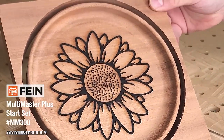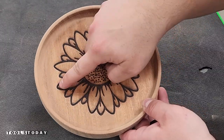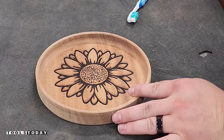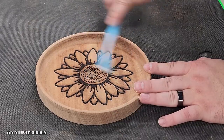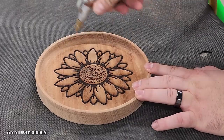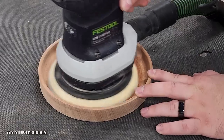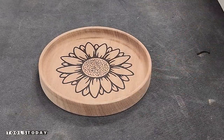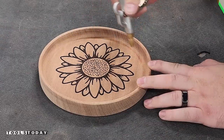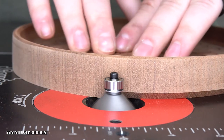We can take those over to the bench and get all of the tabs trimmed off. With the laser one, there is a bit of soot left and some over-burning since I had the laser set to full power. So I blew it all off and used a toothbrush to get rid of any soot, blew it off again, then hit it with some 220-grit sandpaper to get it all sanded down. All the other trays needed absolutely no sanding, but the laser engraved one needed just a little bit. After a final blast of compressed air, there's no soot coming off when you touch it.